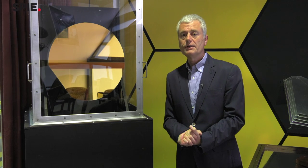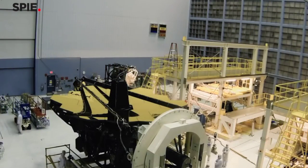This is a beryllium mirror called the SBMD — a sub-scale beryllium mirror demonstrator. It's part of the philosophy used on JWST, which is to do technical demonstrations of complex technologies before building real mirrors for the telescope. The big challenges with beryllium are polishing it to the required prescription — beryllium is a very stiff metal and you put stress into the mirror surface as you polish it, which means you need to remove that stress during polishing, making it much more complicated than polishing glass. We built this demonstrator to verify that the mirror was stable at the right temperatures and that we could polish it to the required prescription.